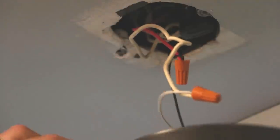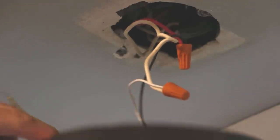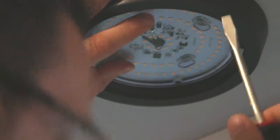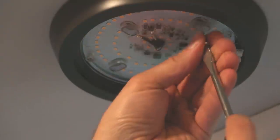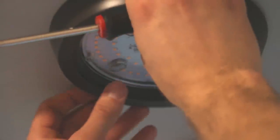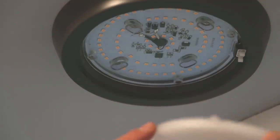Just to test it — let's see if it works. There it is, it works very well. I probably should turn off the circuit for this, but I've got a light switch right over here. I think I got the right spot now — a little work to line that up. I was able to get those screws right in there and it tightened up just fine. Then take this flap — it has these two little tabs — line that up and it shuts like that. When you open it, just press it again. Flip it on — and it works.